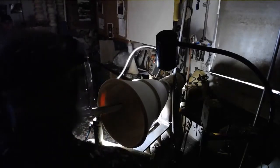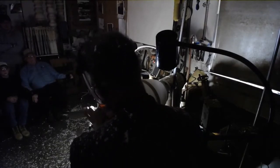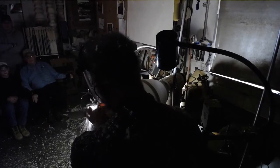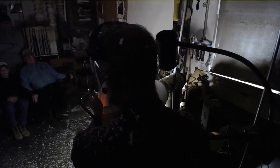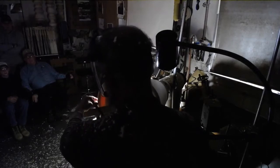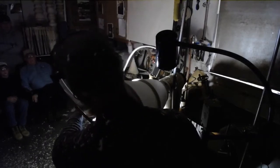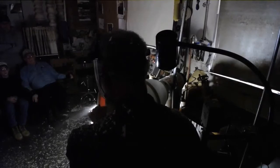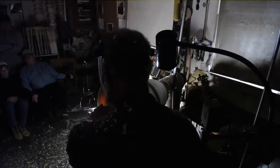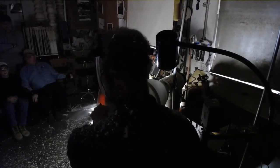So, remembering where the grain direction is going, the grain's this way, so I can do a little work off the end in this direction. It's actually a mirror image of the cut I was doing on the rim from that side. And that gets me to about a half inch rim at the outer part. The cut I'm doing right at this moment is that drag cut. I'm not really following the bevel at all.